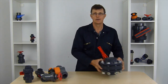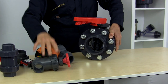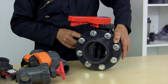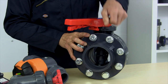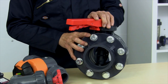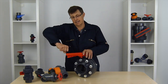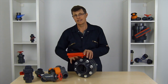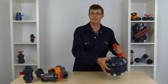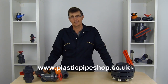You can get butterfly valves which have a gear mechanism on top, a bit like the fine control valve — maybe 10 turns for the gear mechanism to close the valve. Certainly any valves above 200mm tend to have a gear mechanism, because they can be quite hard to open and shut otherwise. From an occupational health point of view, because of the force needed to turn that lever, a gear mechanism is recommended, and it also stops water hammer. I hope that's cleared some things up about valves. There's more information on our website at www.plasticpipeshop.co.uk. Thanks for watching.